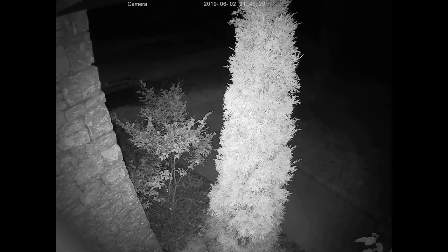This is still a better improvement over my last camera, but I think we can get an even better image. Unfortunately, that cedar tree is blocking a lot of my IR. I think if that cedar tree wasn't there, I wouldn't have to do anything to the camera at all — it would look perfect. But since it's there, I'm going to have to mess with the BLC settings and probably the WDR settings to see more and illuminate past that cedar tree, because right now it's blinding everything out and you can't see anything past it.